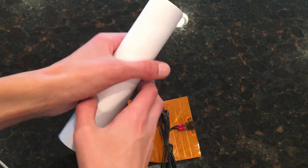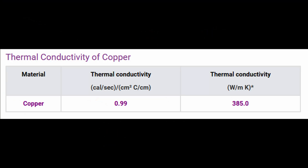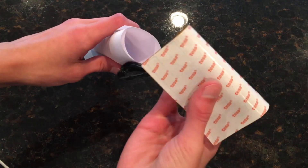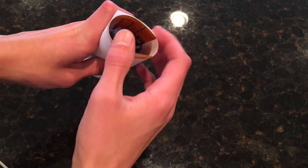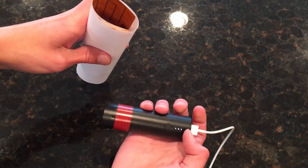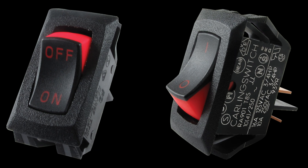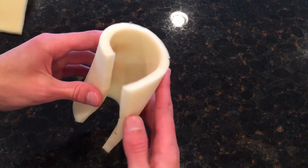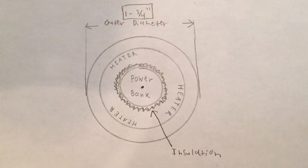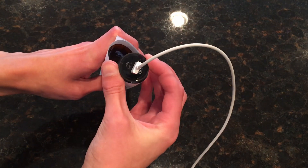So what's the actual plan for making these hand warmers? The plan is to get a metal tube — preferably copper, because copper has very high thermal conductivity — and stick the heating pad on the inside of the tube. When the heating pad heats up, it'll heat the tube, and if you're holding that section of tube, your hand will heat up as well. To power it, we'll take a circular power bank and put it inside the tube so it's all compact, and add an on-off switch. I calculated that I need a tube with an outer diameter of about one and three-quarters inches and a wall thickness of an eighth of an inch.